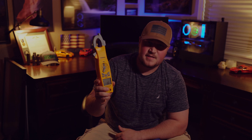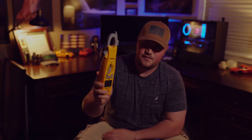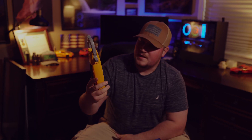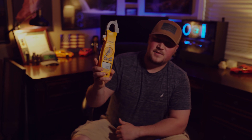These sections here — the hertz through the amp clamp — are one of the areas I had problems with. You would clamp onto a conductor off a VFD and this will display the frequency. The first one I tested was for a condenser fan motor for head pressure control on a chiller, and it was giving me all kinds of erratic readings — it was all over the place. I checked the manual and found that the sensitivity range in the 100-amp mode is only down to 7 amps. So if whatever motor or load you have is pulling less than 7 amps, this does not give you a reliable reading. I was able to get intermittent readings once it got to about 5.5 to 6 amps, but it was so erratic that it was basically unusable. I found another motor I could ramp down to 7 amps and it was able to read — I'll put some of that video here so you can see it works with no problem at that level.